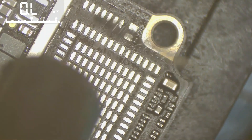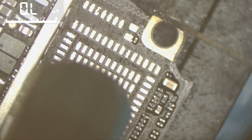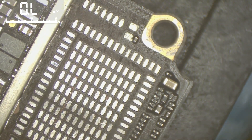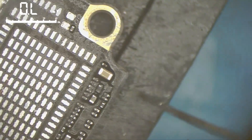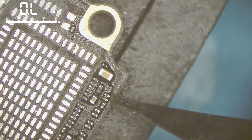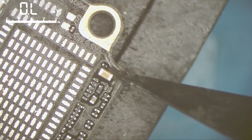It may also show you that you've spent a long time heating the board, and now your phone may have died because of excess temperature. You can see here that the small components got those solder balls because their thermal mass is very small. But if you look at this capacitor, still nothing — because it has a high thermal mass.